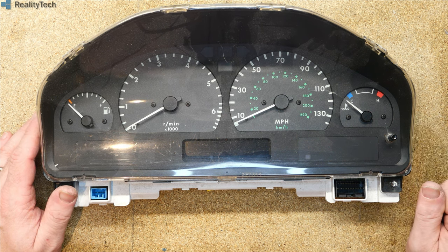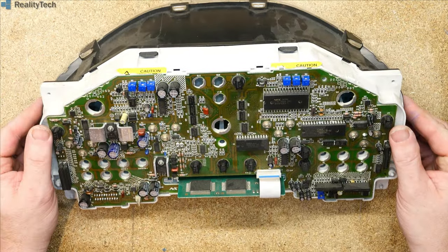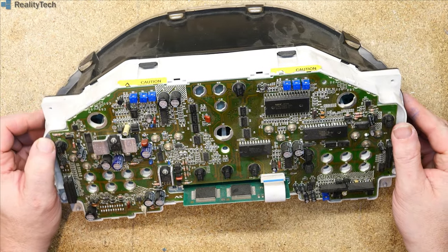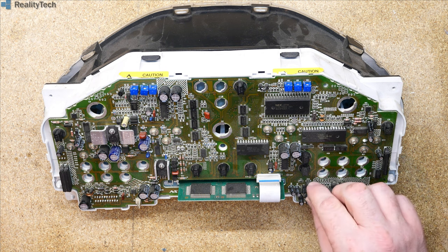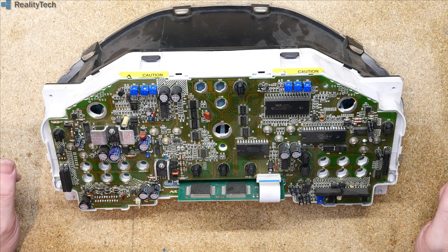What this means is, for a vehicle that was built at the beginning of 2000, you have, unusually, a dashboard like this, which is fully electronic. There is no mechanical speedo in here, although a lot of vehicles were using speedos that were done electronically at that time. The level of integration in here was something else. There is no trip counter, no odometer actually in the speedo.